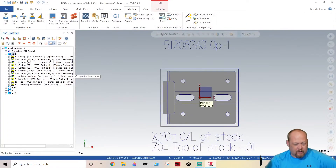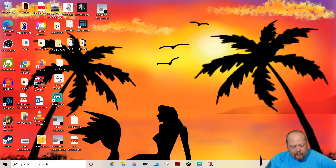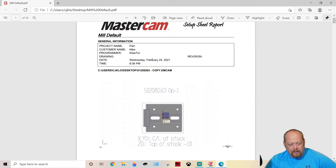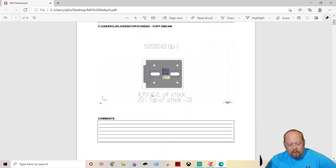When we get done with our project, we're going to be able to, with this method that I have, get our setup sheet and it's going to tell us an elaborate setup of every single tool path and every single tool we have — with the holder — as a whole package deal. You're going to get a Mastercam setup sheet report, and you're going to be able to plug all this stuff in on the top. You're going to have your work coordinate here typed in.